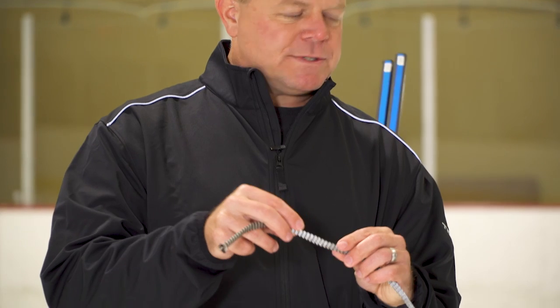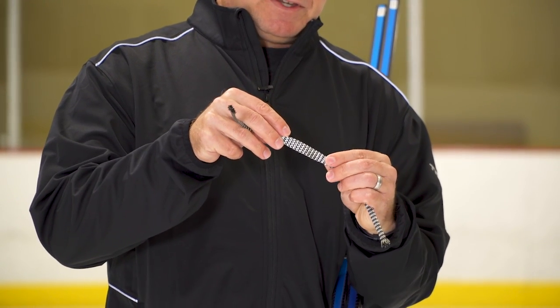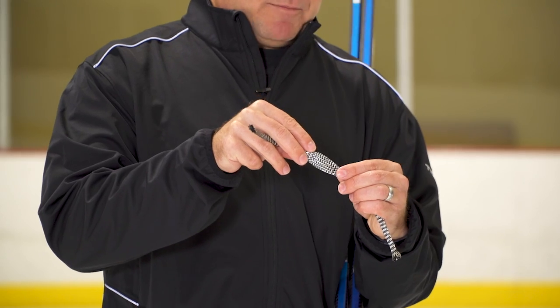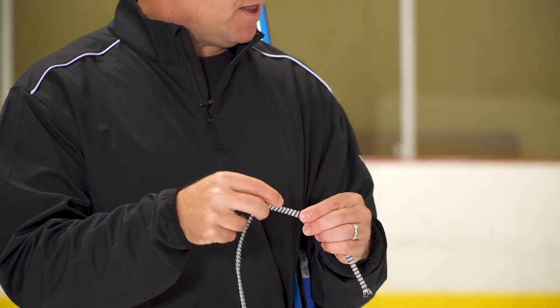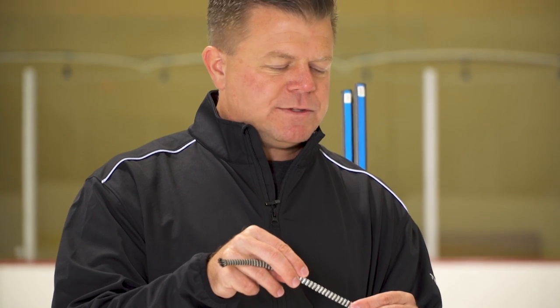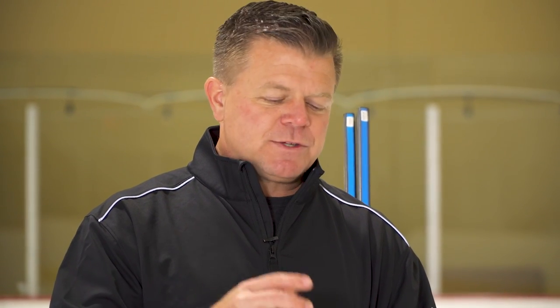So what the braided rib material does, we put some foam inside of this braided tube. This braid can expand and contract during cure. It prevents those fibers from buckling, creates a lot of pressure inside of the braid and inside of the core of the blade, which gives you a very solid structure. It's also a little bit easier for our operators to manufacture.